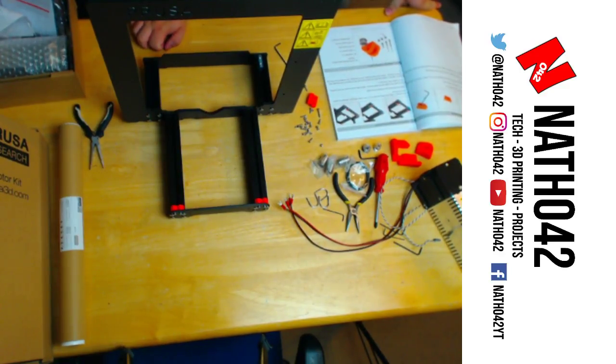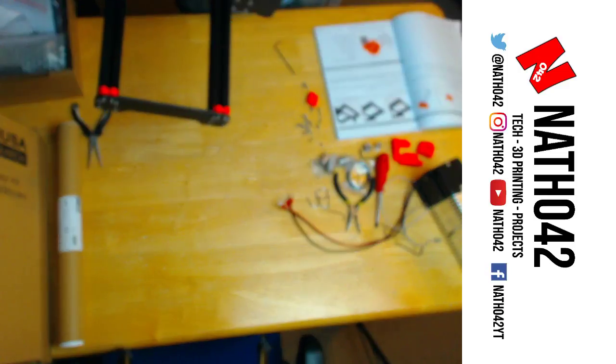So on the other side, it just says, second, take the wire holder back parts and secure them with M3 10 screws on the rear plate with short extrusions. Tighten both screws equally, but not completely. We'll tighten them fully later on.